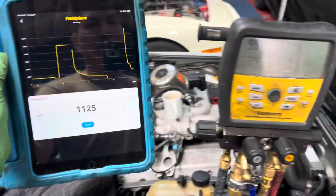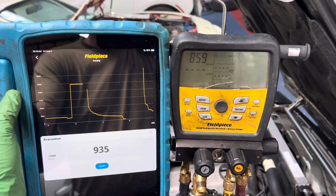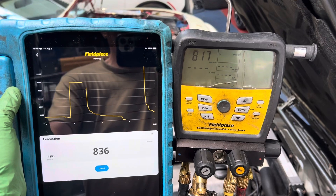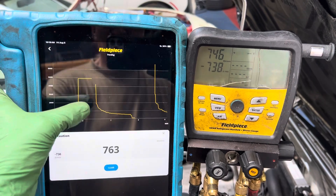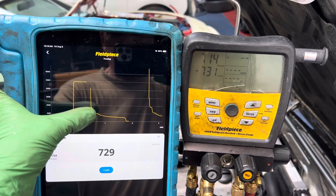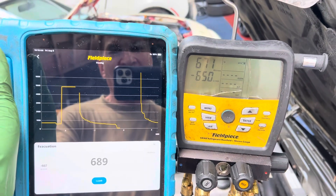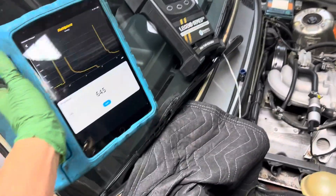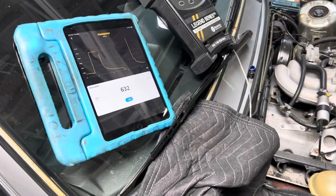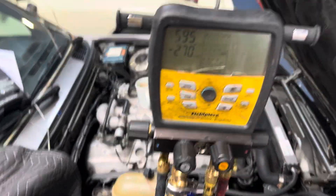Let's see if you notice something different in the shape — like a waveform pattern on a spark plug on an oscilloscope. Do you notice it's not leveling off as high? It's taking a deeper dive faster. Look at how that gradually sloped off the first time we put nitrogen in — now look how steep the second one is and it's getting down there. That is the difference. Nitrogen sweeps — it doesn't absorb, it sweeps the moisture out of there. This one is highly moisture-contaminated; I should be way below 500 real fast if it was mineral oil.